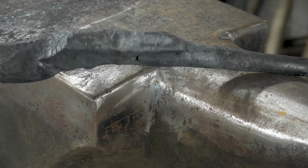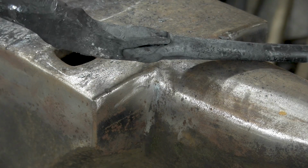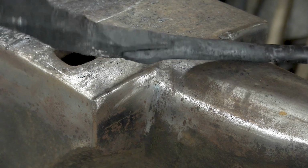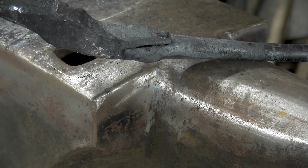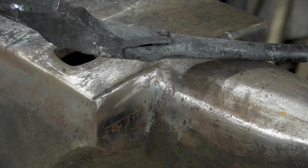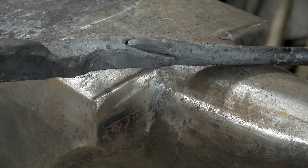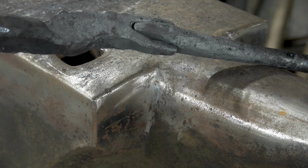So what we got with this guy, we got plenty of material by the time I squeezed this together. And you got that sort of V-weld and cleft weld thing going on here. Not cut as deep, not as much work in it with filling around and trying to do the fit up, and not as much of an overlap where we can see that difference. I'm going to be really curious to see what this does with sand.